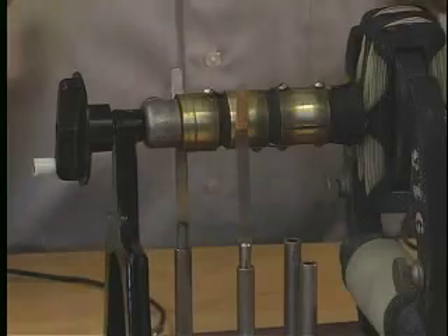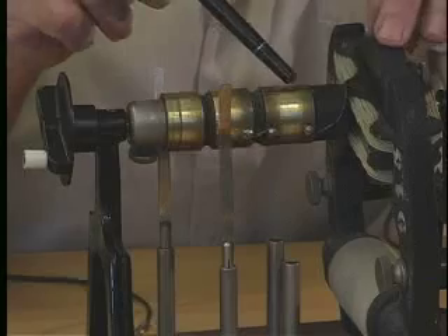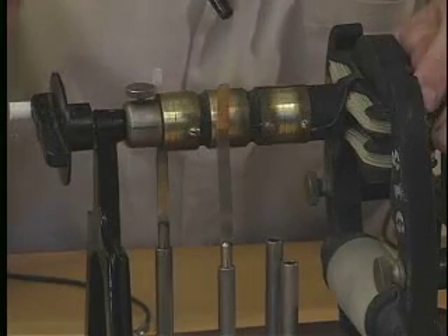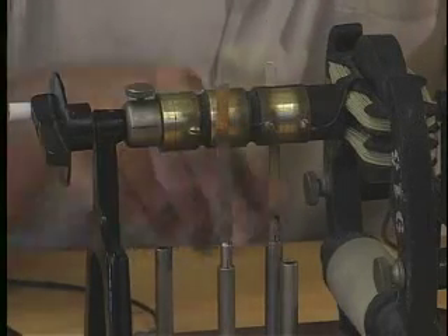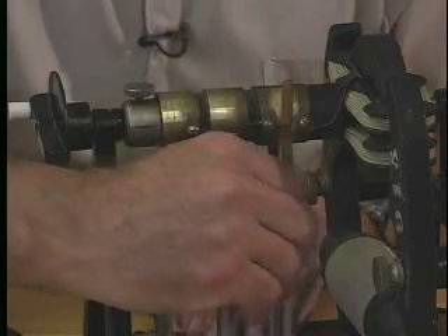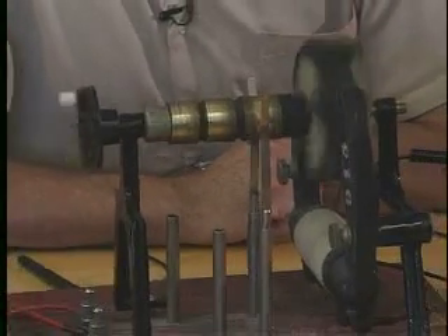That's the purpose behind this commutator here. You'll notice that it's actually split — we've got a ring here which is split in two, and every time it rotates, the direction of the current reverses. So I have to take these contacts out and put them in here, and put them in here. Then we turn on the electric current again, and you'll notice the motor runs perfectly happily.